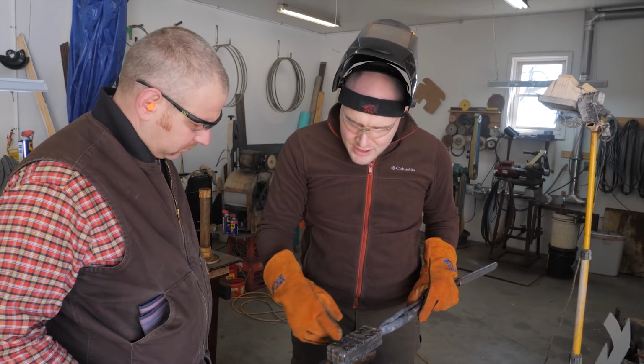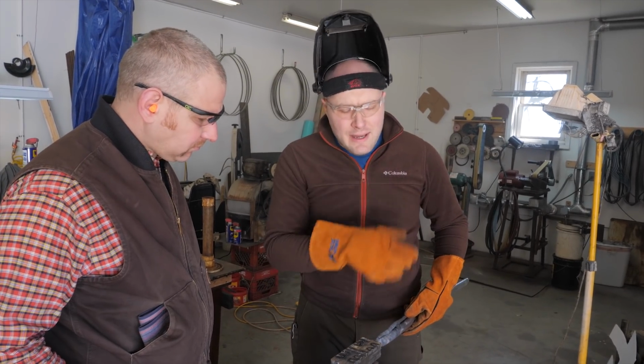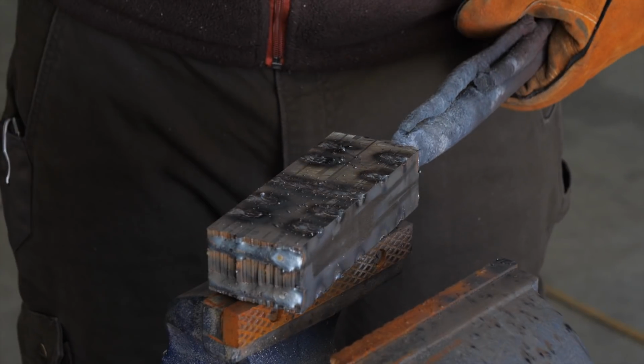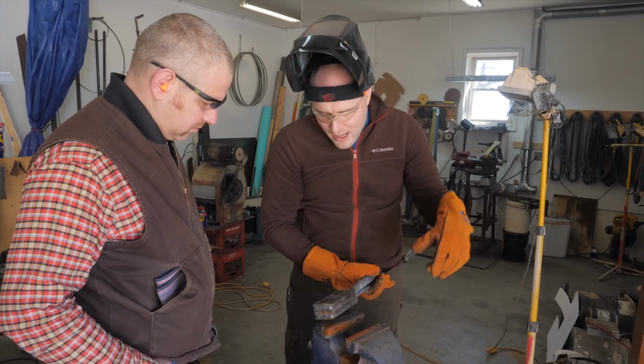No matter what, I always put some welds on the sides and that helps with that, but I'll probably be real careful here and make sure I get lots of flux and everything on this since the forge is heated up already. When you do this on your own, I recommend heating the billet up with the forge. Okay. Got it tack welded up like that.